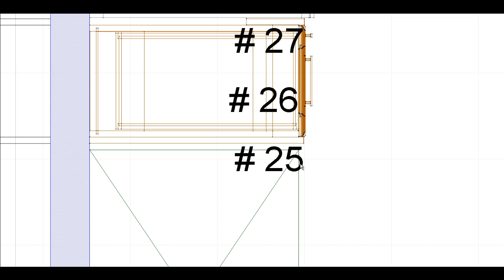You could do it 6 inches and save yourself some money, but sometimes, if there's enough gap here between the refrigerator and the base cabinet, you might be able to see back there. You don't want to see unfinished material. So I put a full-on finished end in there.